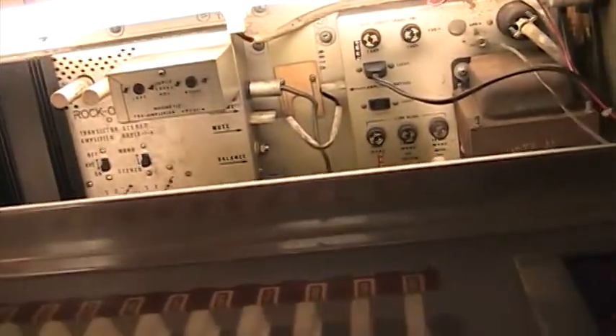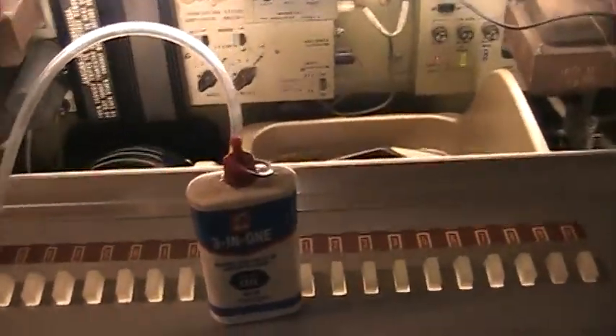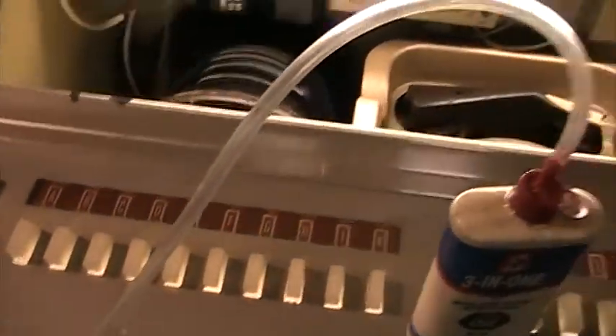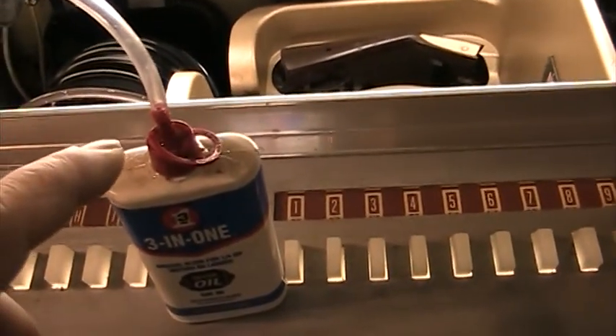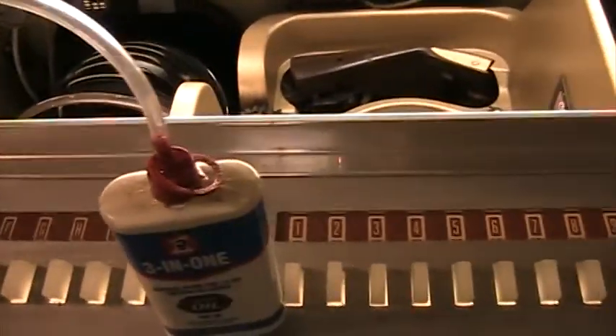There were some gears back here that were really hard to get to that I wanted to re-oil. As somebody had recommended, they recommended the 3-in-1. I'll give you a little tip: if you have a gear that you need to oil that's really hard to get to, this plastic thing right here is just fishing aquarium tubing. That fits right perfectly on the nipple of the oil can, so it can get you to the really hard places.